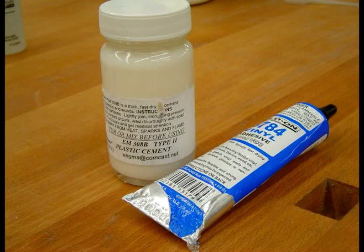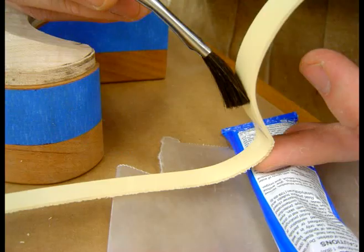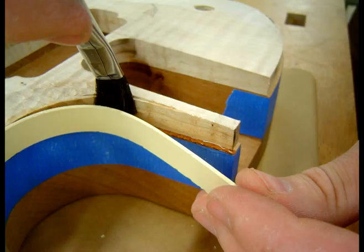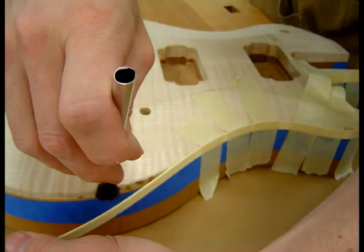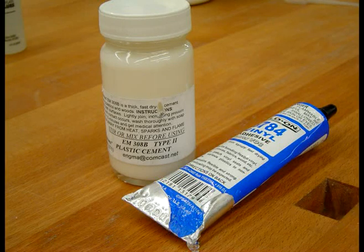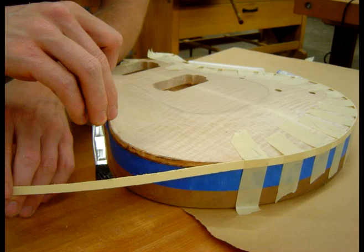Another type of glue very useful in guitar building is what's known as plastic cement or vinyl adhesive. This glue is used to bond plastic to wood — specifically in our case, plastic bindings to wood guitar bodies. These glues are made out of synthetic resins and organic solvents. They have harmful vapors and can be irritating to the skin and eyes, so it is necessary to take precautions. One of the drawbacks is that the cure time is very long. Since the glue actually softens the binding material, you must wait usually at least 24 to 48 hours before scraping the bindings flush with the sides. Fortunately, LMI now has a plastic cement product that significantly reduces the wait time, pictured here in the glass jar. It has a fast tack, sets up quickly, produces less fumes than similar products, and you can even use it on oily exotics like cocobolo with good adhesion.